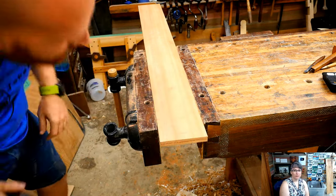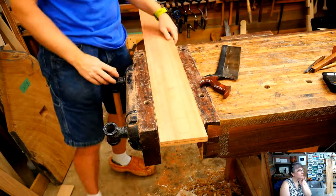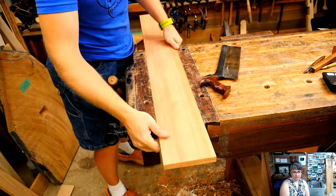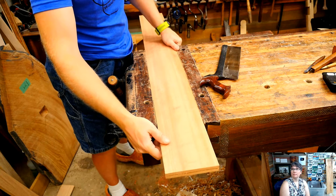So Bryan Fulmer wants to know, did you say that that has rip teeth, your saw? Yeah, the frame saw, it has rip teeth, yes. Because you're cutting with the grain, you want to rip.